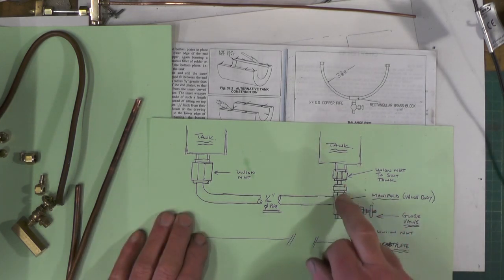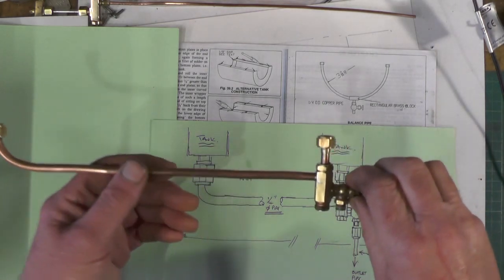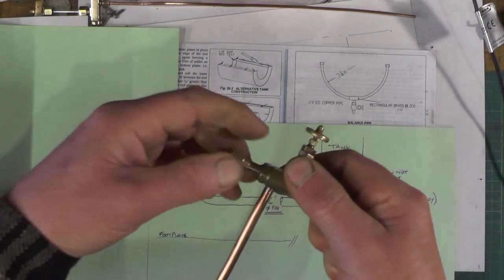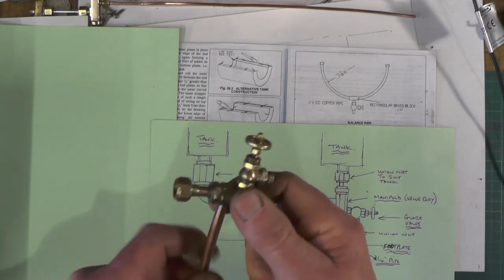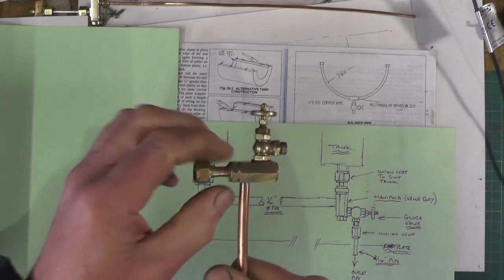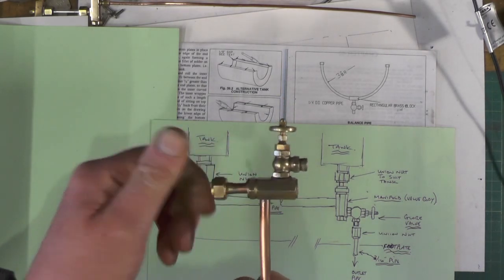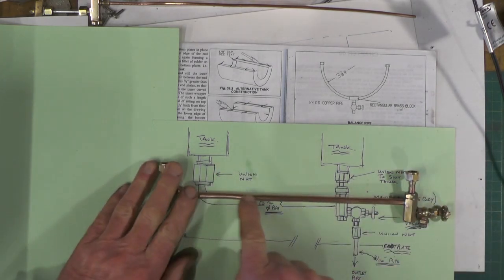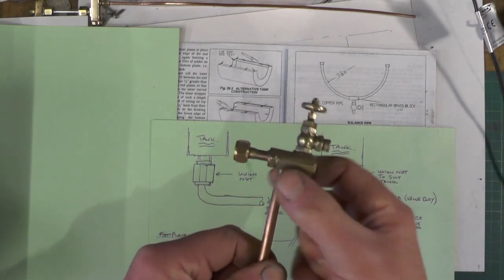It's all completed now and I'm ready for fitting it to the loco. I already had my globe valve from a previous video, and my union nuts which I've shown many times. I've just made this little valve body - it's got a hole straight through it to accept the pipe. The parts have been soldered in, and the olive or nipple soldered onto the union nut. Then I've drilled a hole in the side at the relevant height to make it horizontal underneath my boiler, and soldered this quarter pipe in.